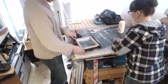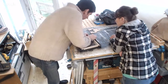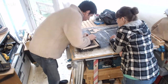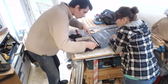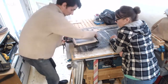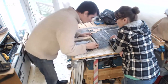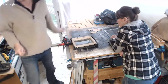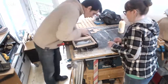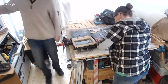Right, put that on that. That's on there. Just keep moving around though. It's because it's got no ties or anything in there. And when we did these mitres before, we put the dominoes in there, didn't we? Yeah. Good enough is good enough, as they say. Right, if you want to just grab a chisel and scrape that glue off those end bits there. Have a bit of kitchen paper or rolled rag or something.